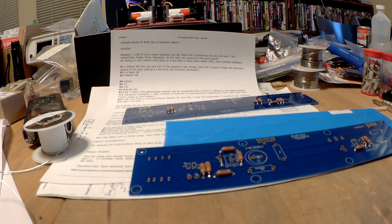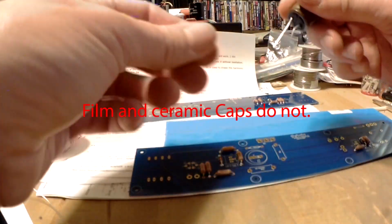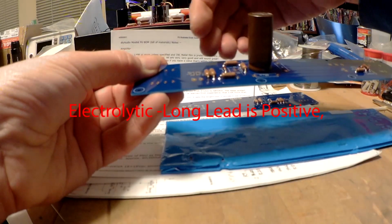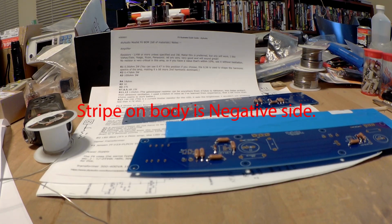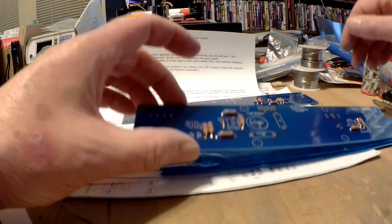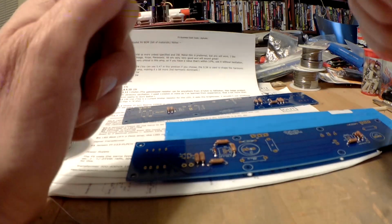So somewhere I'm supposed to have 1.10 ohm resistors. I hope I didn't get back ordered on them. And I have some nice huge capacitors here that I'll eventually mount. But again, this is where you can have issues, because all of a sudden now you're having to reach around this big old part, and you run the risk of burning it with the iron. So it's best to hold off on those. Start with the low parts, get them all installed, and then go to the higher up parts. So I'm still not done with my resistors.